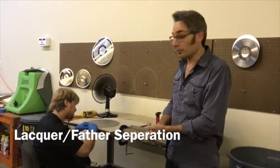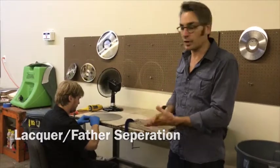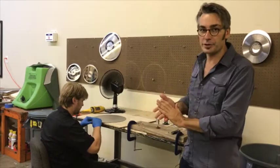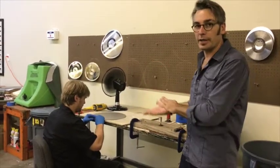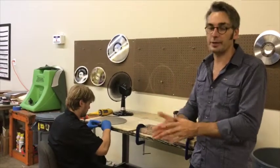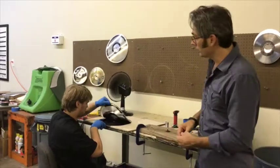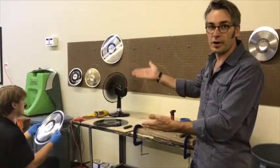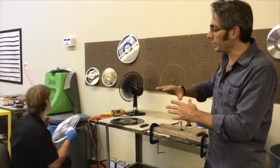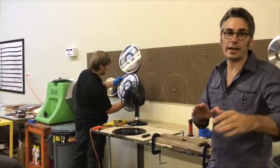This is that lacquer out of the high-speed plating. We've got our nickel on the back of it — it's about 111 microns of nickel. He's going to separate this now, and this will have ridges, not grooves. Then it'll get cleaned and put back in the plating to make a mother, which has grooves, and then that will get plated to make stampers — it's called a three-step process. Notice how carefully he peeled it off: he didn't bend it too much, he didn't rotate it, he didn't cause any bends or scuffs. A good visual inspection and another cleaning, and it'll go back in the baths.